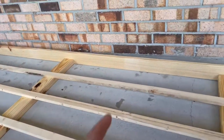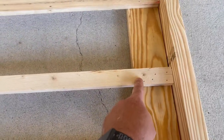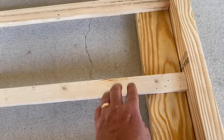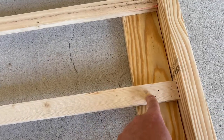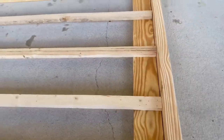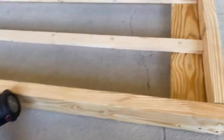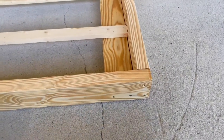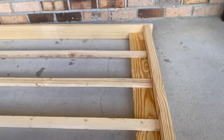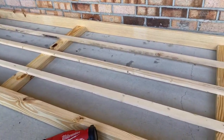And then of course some screws through the top. What we used on the strips was brad nails, because these strips are kind of fragile when it comes to screwing and you'll start cracking unless you drill holes. We don't really want to drill holes in everything, so we pulled out the brad nailer. We're using 1 1/4 inch brad nails and 2 1/2 inch screws — that's pretty much the list of things. Now we're going to go put this in place and see what it looks like.